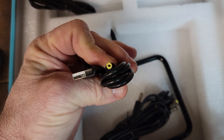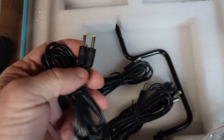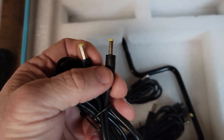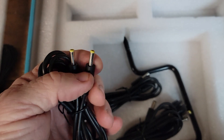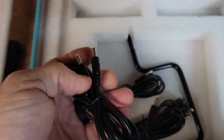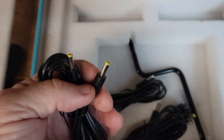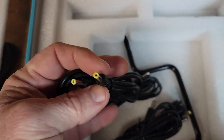Here's your charger — you plug it into the wall like a cell phone to charge it. I like to charge mine out in the sun, and then at night if I'm in a hurry, bring it in and let it charge by cell phone, then take it back out the next day and put it in the sun. If it's completely dead it may not need that much — it just depends on the lights. So that's your 4.0 by 1.7 — that'll fit your Spartan Go camera, Tactacam Reveals, any of the Reveals. Now the Spartan Go camera is a 6-volt camera, so don't plug it into a 9 or 12 volt — plug it into the 6 volt. The Creative XP, Barn Owl, Wise Eye, Bigfoot, Sniper, Covert — those all use this same plug size.